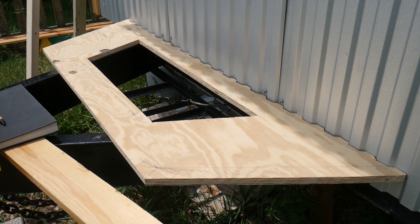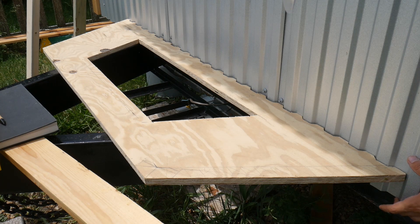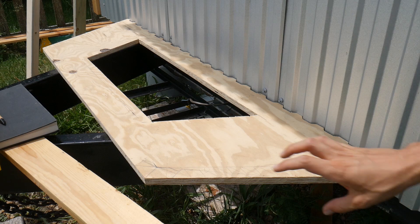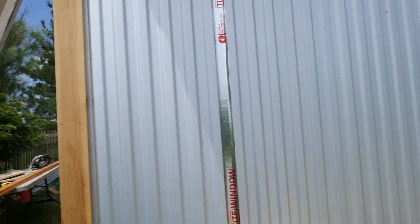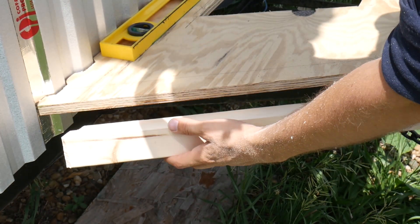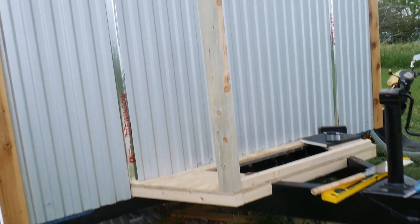There it is — it definitely lost some structural integrity with that hole. It's still pretty strong but over time it will weaken. So I'm taking a two-by-four, splitting it, and putting one half on the bottom so it meets the metal and I have an even bottom, then one half on top, and anchoring it through for good support all the way around and something to screw through for sheathing. I've got my flashing tape strips in — really satisfying to put in — and now I can start getting the wood in there.